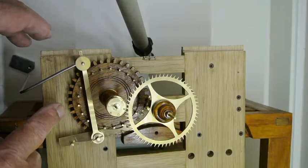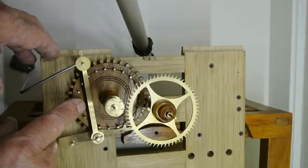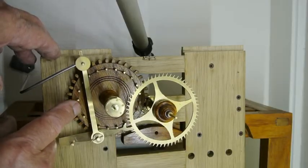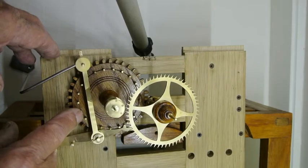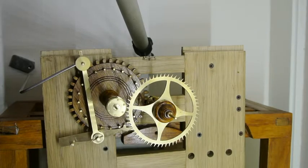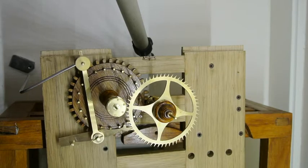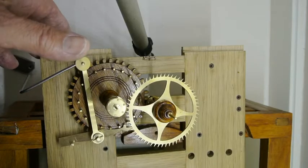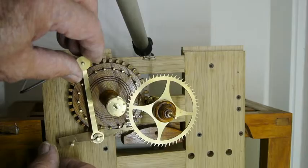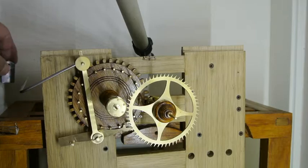Now the power when the clock's running is moving the wheel in this direction, and when you wind the clock up it removes the power from this wheel, and that would cause the escape wheel possibly to trigger the pallets and let this whiz round and tear up the faces of the pallets on the Grasshopper escapement, which are very fragile. So he invented this system of keeping power on when you're winding up, and it has to be manually triggered, and it consists of a lead weight which powers everything.